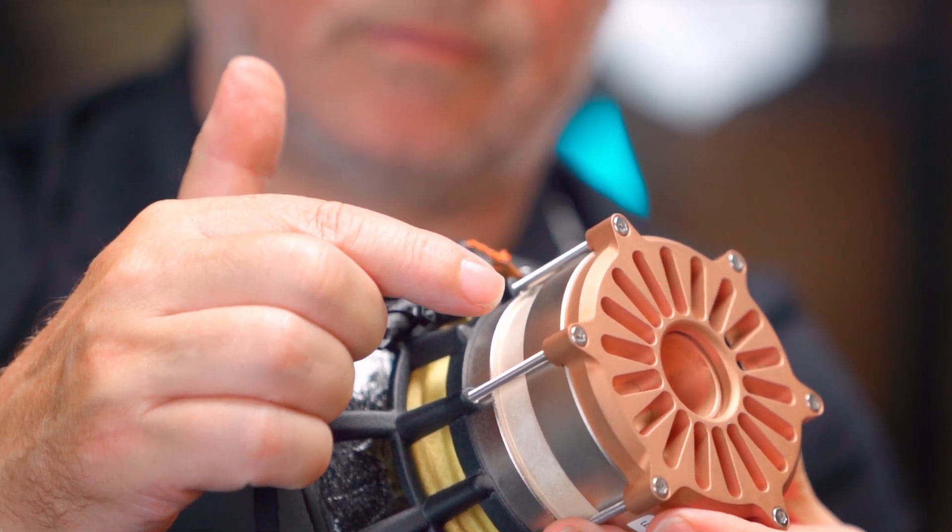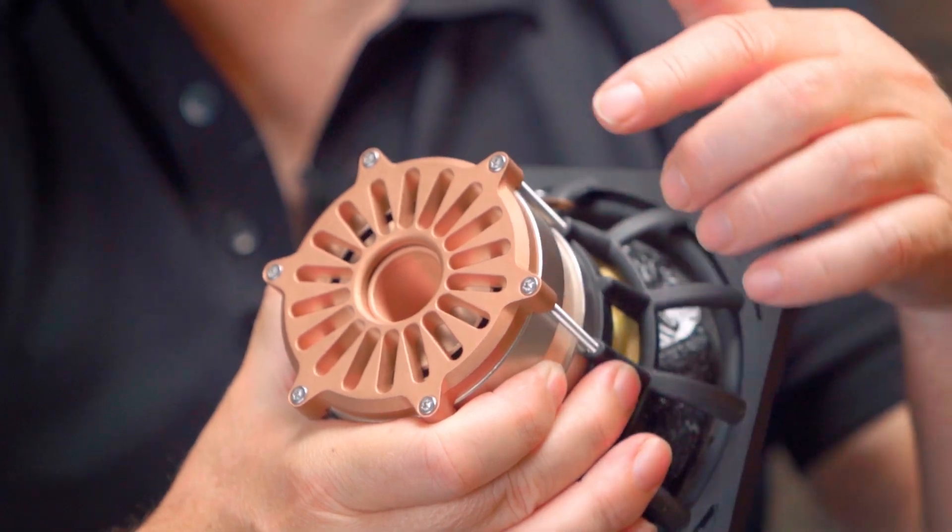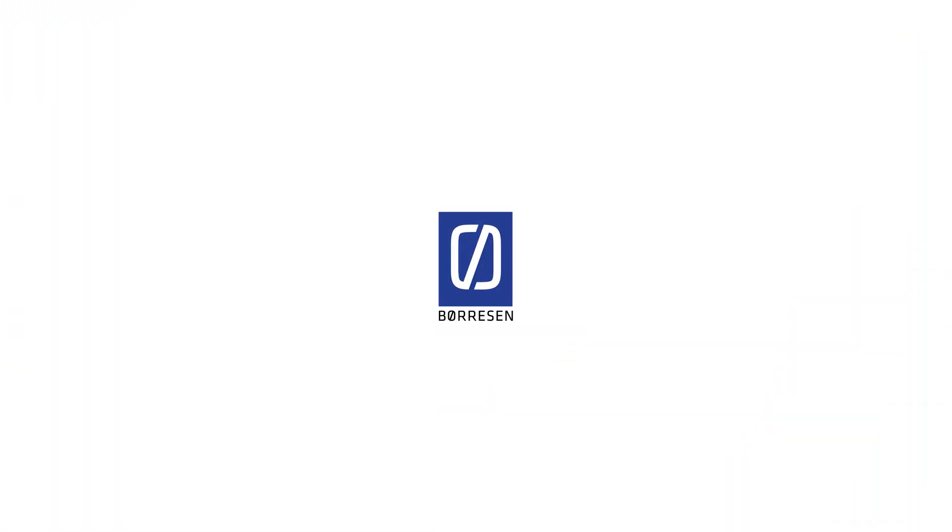Instead of 10% flux variation left, with silver there's only 8% of the flux variation left. It's like putting more horses into your car and getting better torque at the same time — you simply have that ability to follow transients more closely. What you get is a sound that is increased in dynamics and scale and ability to resolve the fine details. That's why magnet systems are important.